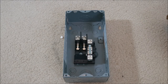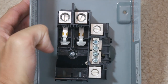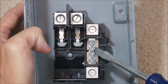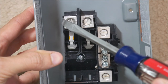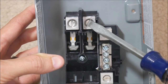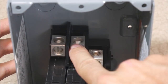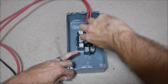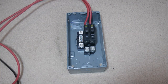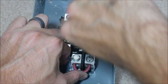Inside the cover you will see three or four large connection points, a bus bar, and some plastic slots for the breakers. The vast majority of the time these boxes are going to be wired up with AC, which has at least three wires that need to be connected. DC only has two: a positive and a negative. So we are going to make a modification to the box by connecting all of the contact points that touch the breakers into one positive circuit. The negative side is already good to go. So all you need to do is connect the two positive terminals together using a wire. Make sure the wire is not too small to carry the current that you will be using. The wire will be very short so it won't really need to be super thick, but you also don't want to use something really small that will create a lot of resistance or get too hot.